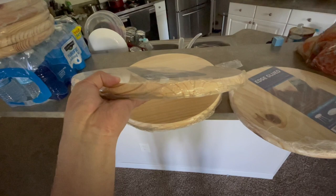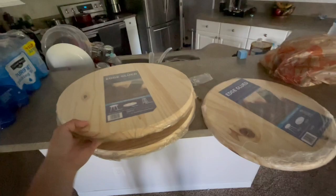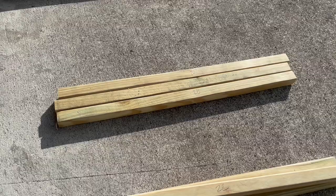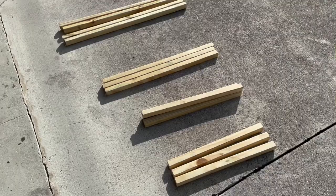These are pretty thick, very sturdy. Each one's about an inch, so you'll have an inch on the top and an inch on the bottom — keep that in mind when doing this project. We have the cuts ready to go. The biggest table is going to be 34 inches — that's the first cut. Then we have 28 inches next. Then you're going to cut your third table at 22 inches, and then your last table at 20 inches. We've got all four ready to go.